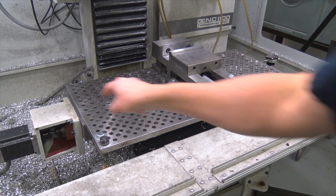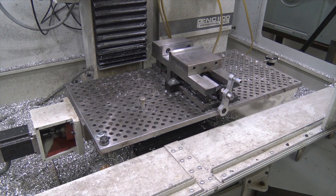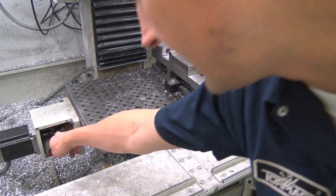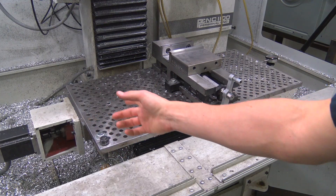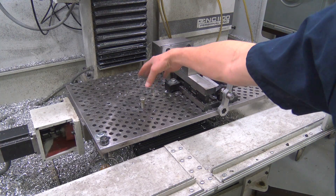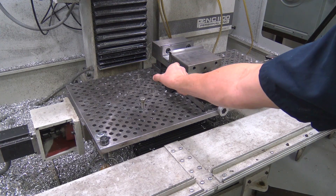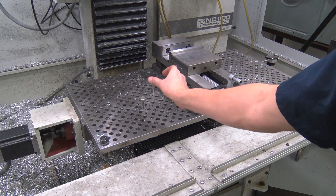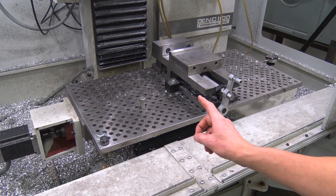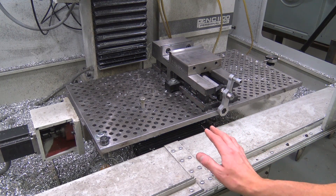Time out — while editing this video I realized we need to take a step back and explain some basics about CNC and converting motors into accurate linear motion. Here's our Tormach table; we're going to focus on the X axis. We've got a stepper motor on the left that moves in steps or increments, there's a coupler connecting to a ball screw — a pretty high quality hardened and ground ball screw. Inside the saddle are two ball nuts, and how those ball nuts are spaced together helps prevent slop. The preload of the ball nuts is not user-adjustable on these machines but should be a couple of tenths at most.